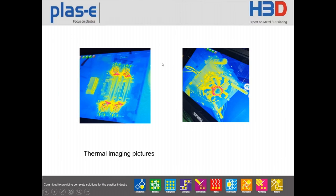This is another mode. We take thermal imaging pictures during injection so we can monitor areas where the temperature is higher or lower. The left side shows a kind of handle parts injection, and the right side shows fan parts during injection. This thermal imaging can monitor the injection process and keep it more stable — it is an online monitor.